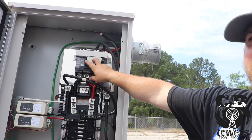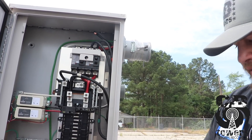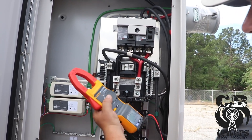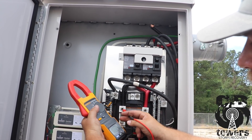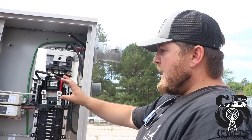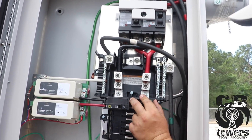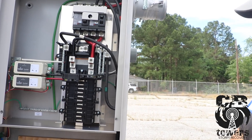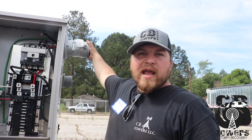You can take another precaution — find the meter for AT&T, and there's a breaker on that meter; just cut that breaker off. Next, take your meter, put it on AC. Check neutral to hot — make sure it's hot and you're getting the same voltage. Come down and make sure it's splitting up right: getting voltage on one leg, getting voltage on the other. Something might have shorted where it's not delivering the right voltage on each leg. Make sure all the breakers are popped in and tripped on. Other than that, call the switch — they'll contact AT&T and let you know the site's on air. And that's it for that.